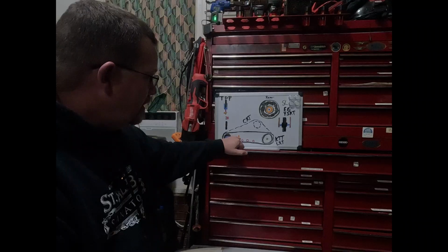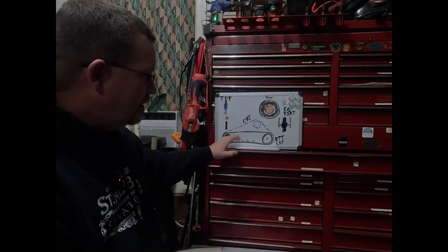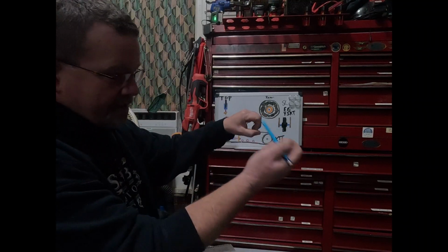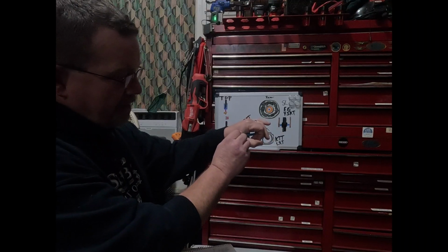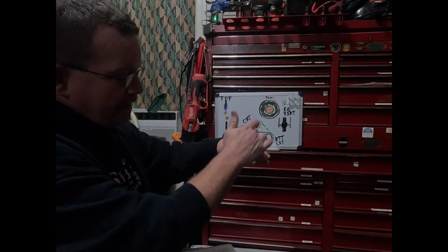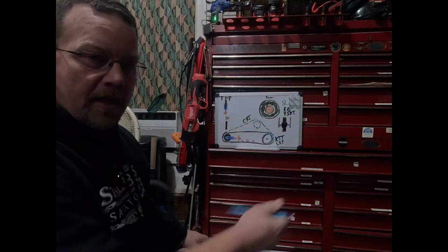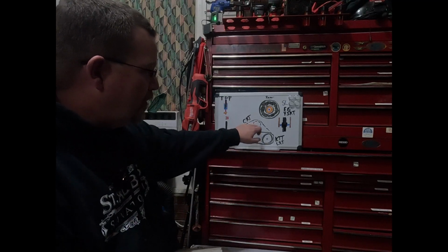Okay? The nut, you could literally strip the nut and the bolt configuration that goes in here. Back here on the motor, the motor will sit here, and let's say this is the shaft. You could just be pulling tension on here. All of a sudden what's happening is you're working the inside of the motor with tension. Over here is where the seal is, and next thing you know, you're burning up the seal.